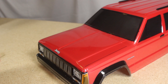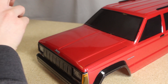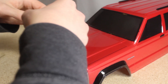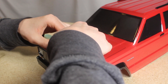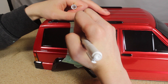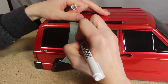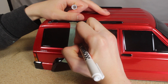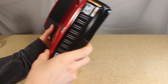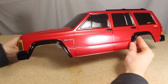Unfortunately I was all out of the tape I like to use for panel lines, so I decided to use some other masking tape to mark the lines and spray them black. The lines didn't really turn out exactly how I wanted — I wasn't getting a good spray with this paint, and probably as a result, the paint bled through the tape in some spots. Masking the lines and painting over them is one way to get clean straight panel lines, however it's a bit time-consuming. So I began using a detail pen and ran it along the tape. This was a bit tricky because the thin ink could easily get under the tape, so in the end I just free-handed most of the lines. I'm not thrilled with the result, but it is a body I intend to bash around with, so there's no point in making it perfect.